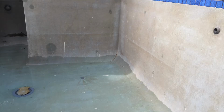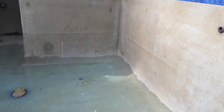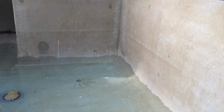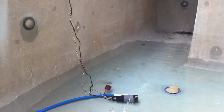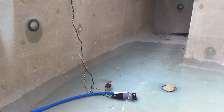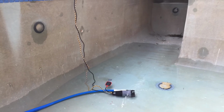So I have the garden hose running the whole time I'm doing this and putting the acid on. And as I said, if there's acid sitting on a step or something like that, you need to bring the hose up to dilute it down once it's done its job, because on the reactive surfaces particularly, it's not so bad on paint and some of the less reactive surfaces, but you don't want to leave acid because it can pit and dig a hole.